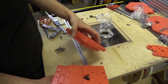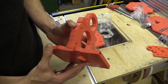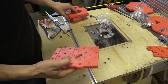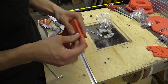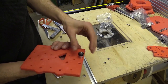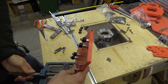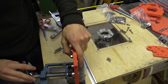So this is the z-plate - those are the nuts. These fit on like this and get bolted on these screws here. What I'm going to do first is start to assemble the wheels. Here I'm using 30mm M5 machine screws with either an eccentric or fixed spacer, a shim, a mini V-wheel and a locking nut. Just using this to push the eccentric spacers in.